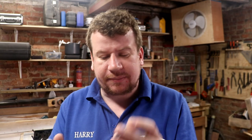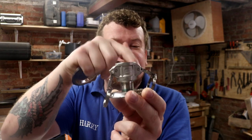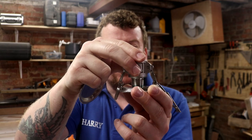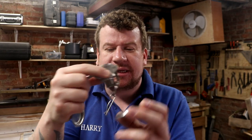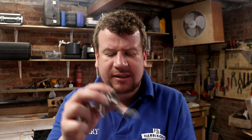One of those jobs is these blanking caps, which will eventually look like that with a RJT nut over there, and then they screw into the top of the tanks, and then we can connect a blow off hose to the top of the tanks to let all the gases out during fermentation, and then we remove this and put the spray ball assembly into the top of the tanks to clean them.